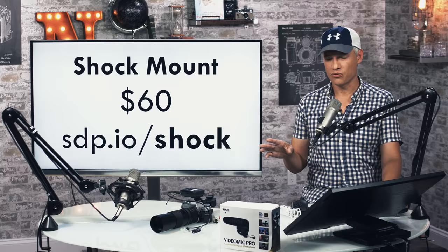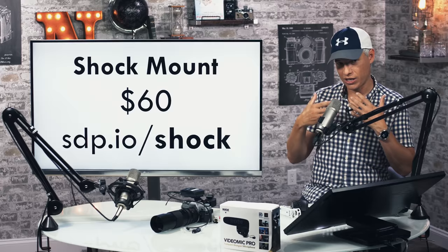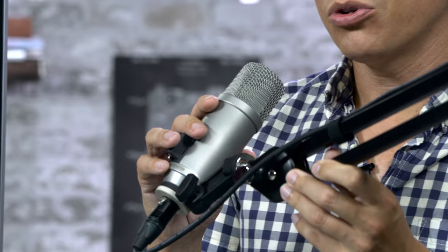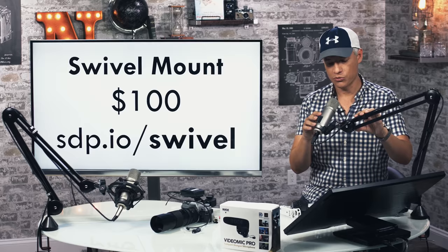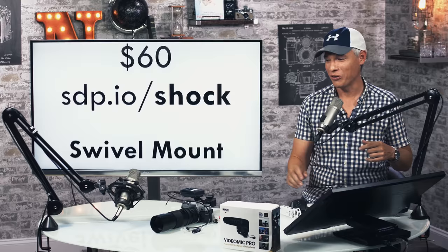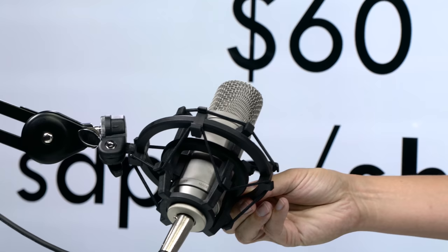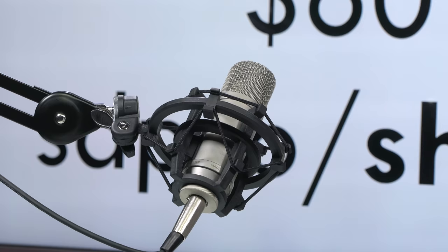A few accessories for your microphones: you can stick your mic on a stand — the Yeti comes on its own little stand — but it's important to keep the microphone a constant distance from your face. A boom arm lets you reposition the mic so you don't have to move your body to match where the mic is, keeping your sound more consistent. Swivel mounts also help absorb some shock — they don't eliminate it completely, but if you bang the table it travels up less. A shock mount is an extra layer of protection that helps isolate the mic from vibrations traveling up the stand.